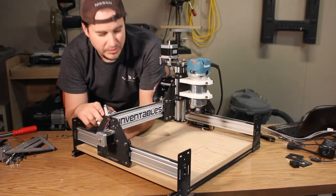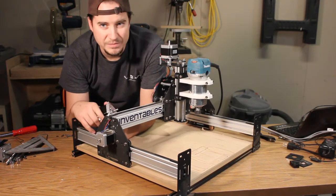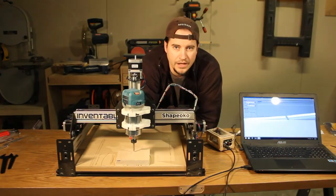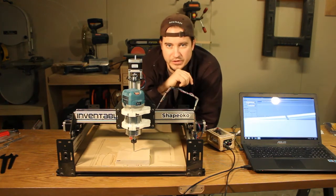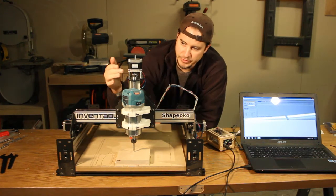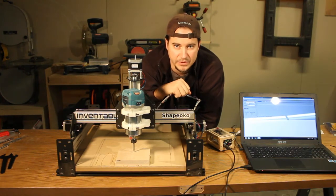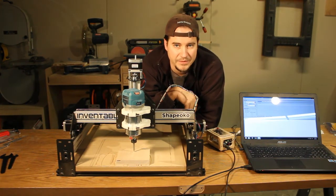Other than that, it's looking pretty good. I'm going to get a program together and we'll test it out. Now that we've got everything set up with the new Z-axis upgrades, there's one more thing we have to do before we start cutting, and that's to change the parameters in the Arduino for the new gear ratios so that the Z-axis moves the correct heights. So let's go over to the computer and get those swapped out.